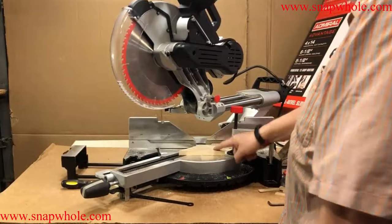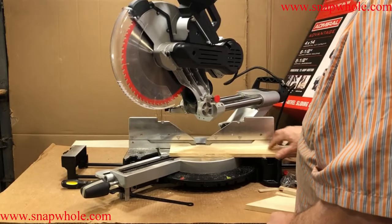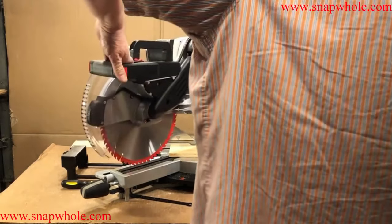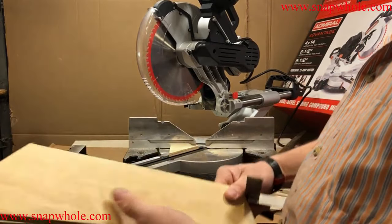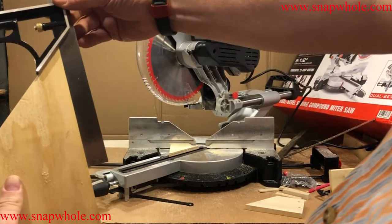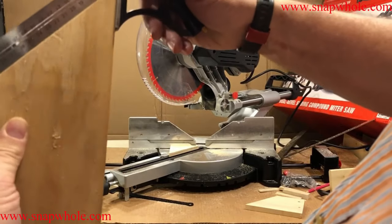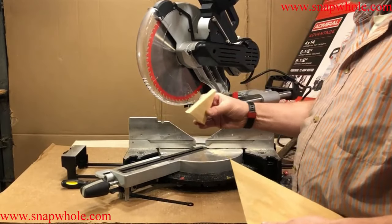I move this to 45 degrees. There's no way I can use the hold-down on that small piece, so let me find another board. I'm going to cut it on this side so I can hold it down with my hand and not have to use the hold-down. This is a piece of plywood — I know that these are square. Putting it like this shows that it's square, and checking the bevel also shows that it's square. So in adjusting the fence backs to correct the 90 degrees, we also fixed the 45 degrees.